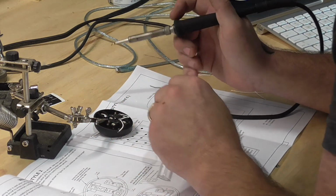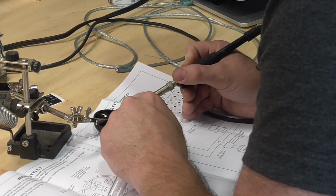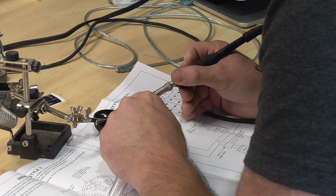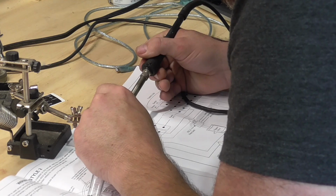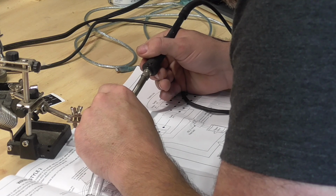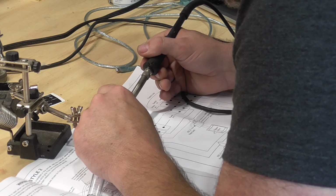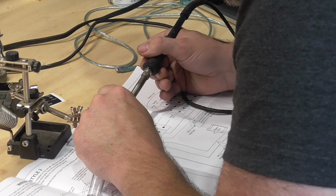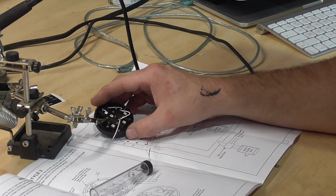So we're running two sticks, two push to talk and trim tab sticks in the aircraft. So I picked a wiring diagram to make sure that works correctly, and that way you can use either one of these sticks at any time, and they set themselves up to a relay. So the relay does the work, the stick just turns the relay on or off. Okay, so there it is, quick and easy.